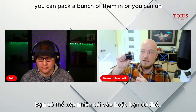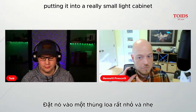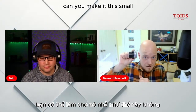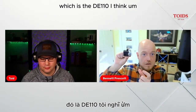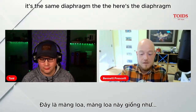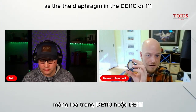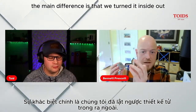The goal was to get this dimension down to less than two inches center-to-center so you can pack a bunch of them in, or have as small a weight penalty as possible when putting it into a really small, light cabinet — without any performance penalty. The original goal was: can you make it this small without a performance penalty, based upon a standard driver we make, which is the DE110 or DE111? It's the same diaphragm — exactly the same tool that forms this diaphragm.